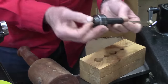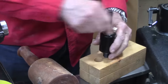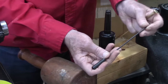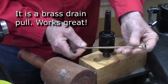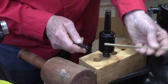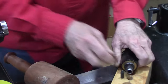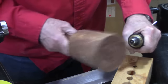You have that same functionality on the one that comes with the large PowerMatic — it also has a removable tip. It comes with a knockout bar, but I've seen most of these knockout bars get bent when used because they just don't have any strength. If you have the opportunity and can remove the point, a brass rod from a plumbing fitting works great — you can just tap that and out it'll come. Sometimes there are advantages to not having the point, although I don't remove it very often.